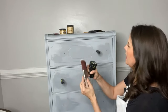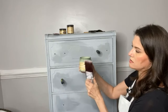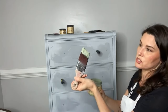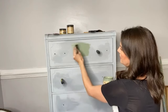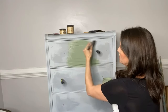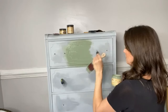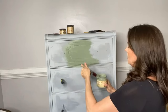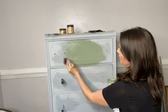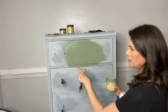The brush I'm choosing today is the mini angle. Does anybody know why I wet my brush? Chalk mineral paint is zero VOCs - there's no smell, and it's a water-based product. This is a brand new jar so it's nice and fresh. Sometimes when you're painting you'll find you're seeing some brush strokes. We're going to do mostly two coats on this project, but we will not be doing the actual transfer today - transfers need to go down onto very dry paint. You spray your brush to minimize brush strokes by keeping it a little bit damp, especially on the second coat.